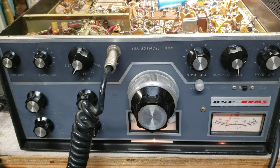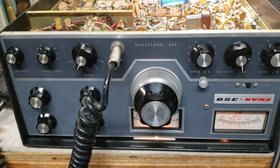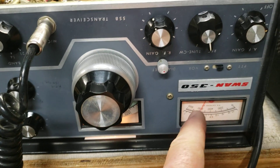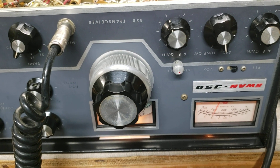What we're going to do is there's a capacitor, C1103, that determines the time constant of the AGC, and I've hardwired it in. You could put it on a switch if you wanted fast and slow, but it really dampened the AGC action as well as the S-meter.